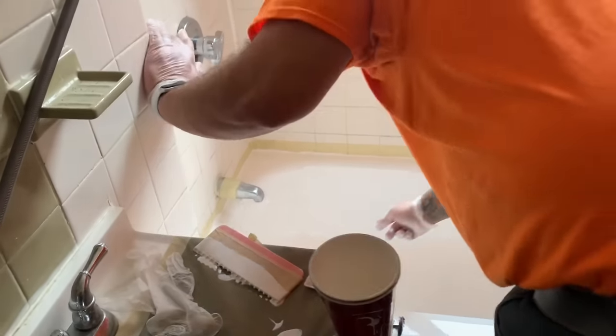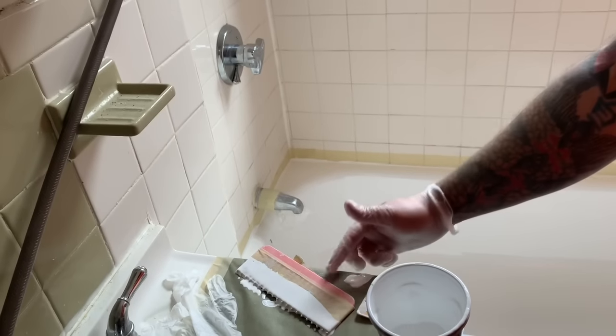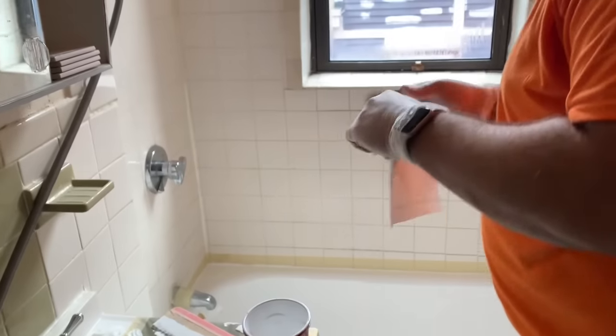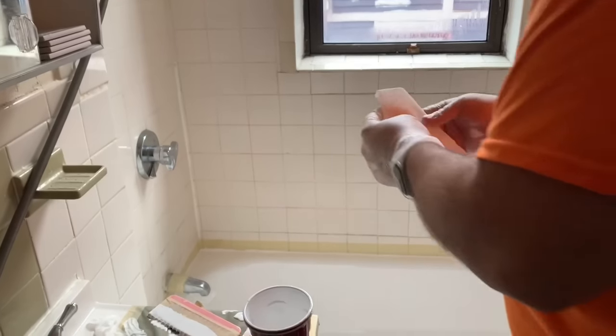You can take the edges — you can dip your finger in the material down where the drain is and just touch any little spot that needs to be touched up. If you get a hair in there or anything like that, as long as you're before the hour to hour-and-10-minute mark, you're fine to go. Since I have to leave, I prefer to wipe off the drain area and try to keep it as clean as I possibly can by using paper towels just to slow down the runoff around the drain area.